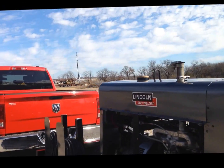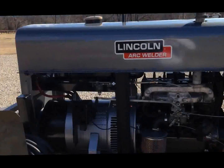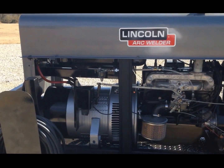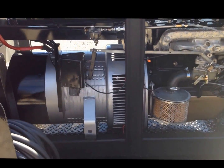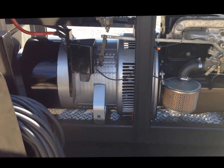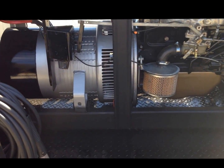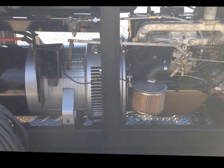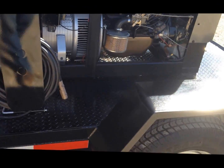I took out any dents in the sheet metal. I have what's called a barrel generator housing, which is the more sought after generator housing. Seems to last longer and hold up better than the hex barrel type housing, and the coils all seem to last a lot longer, and it's just a more valuable piece of equipment when it has a gun barrel type housing on it.